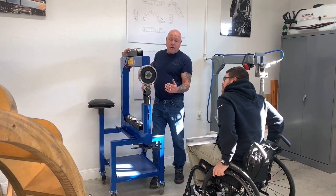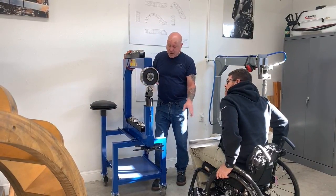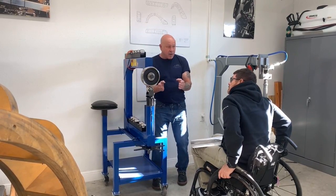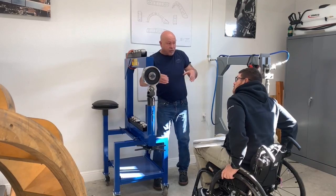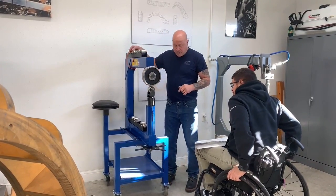So we'll be doing linear stretching with flat tops, getting our shape in the panel. Then we'll be coming into the high crown to linear form to get everything to throw over so that it makes it the right shape to the buck. Okay, so we'll start off with a flat top.